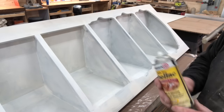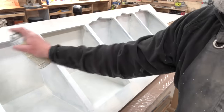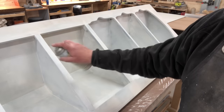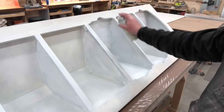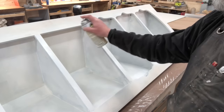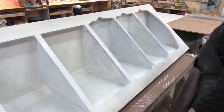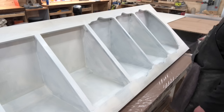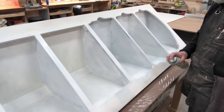He's having a little bit of a bleed-through problem. When painting white or a lighter color, the paint can start to yellow, mixing in with whatever was put on the original product. The fix is a couple coats of shellac spray. If you pre-knew this, you could buy primer that has shellac in it and do the entire piece. But as a flipper, we just kind of wait to see what happens. The spray goes a long way and dries really fast. We're trying to keep costs down — we can't get a ton of money for the items we flip, so we try to make it cost efficient.